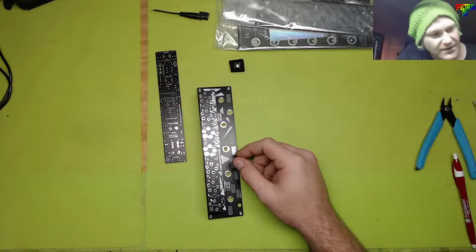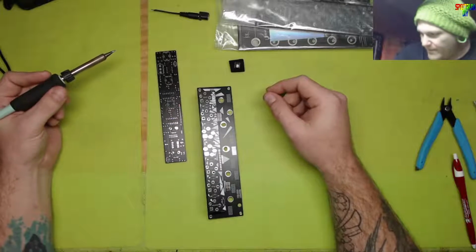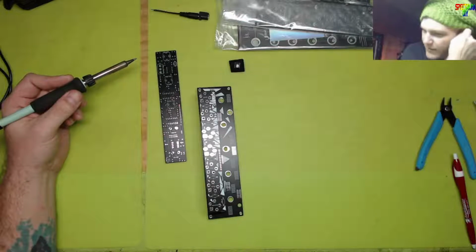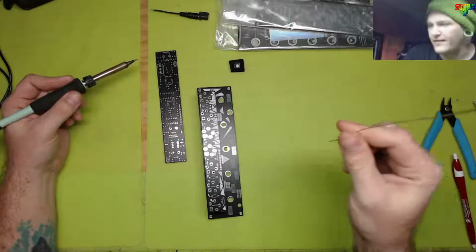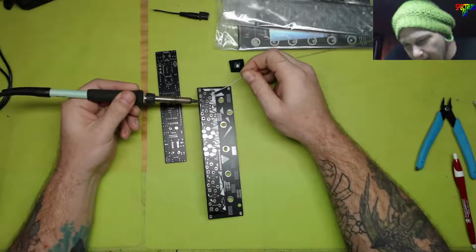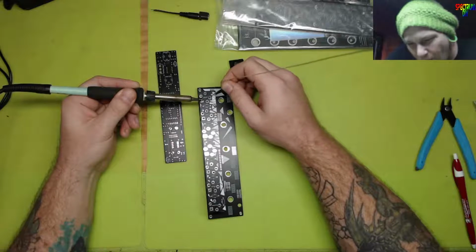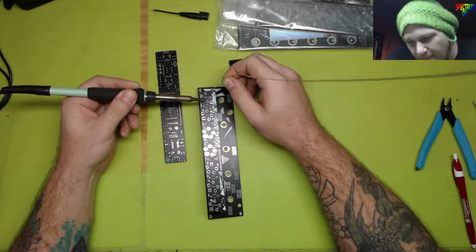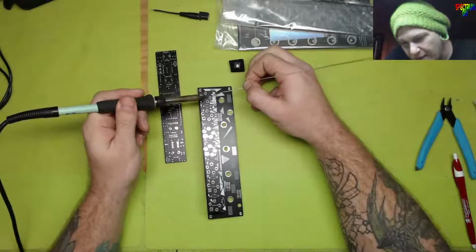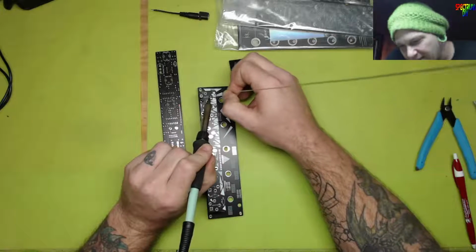And the only thing I would have to do is basically build a whole new VCO and take one of the chips. I'd have to unplug one of the chips out of the socket of my 5-stack oscillator as a test. So that's been on my brain. That's what's been on my brain. A way to synchronize tune, not just synchronize change, but synchronize tune. Well, I mean, I guess as many oscillators as you could slave to the main one.